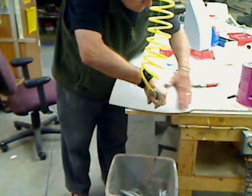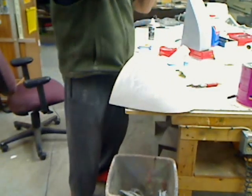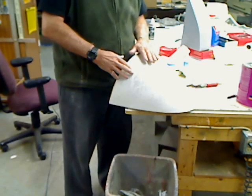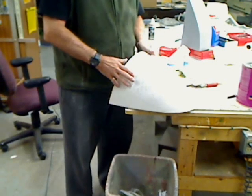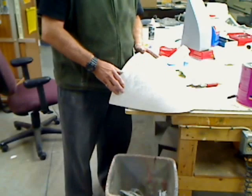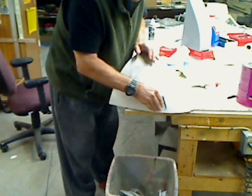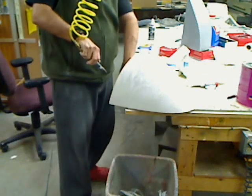It's also not too critical on here because it's really hard to pull a canopy and get a good clear surface. You get a decent surface, but you still get a little takeoff from the material. So what we'll do when we vacuum form is we'll pull one canopy, trim it off, sand it down, wet sand it down, and then we'll pull another canopy on top of that. That will give us a nice clean result. So this is the first part — get this sanded down, and actually it's all ready to go at this point. Take a little wet cloth and brush that off and we'll be ready to go.